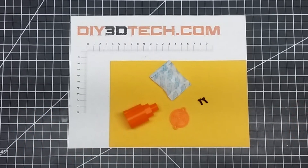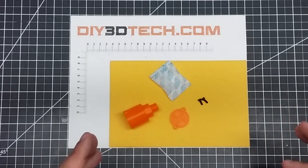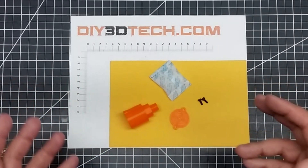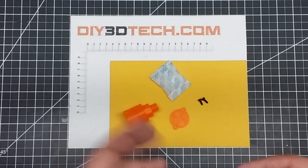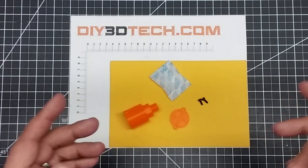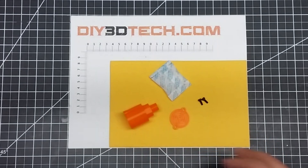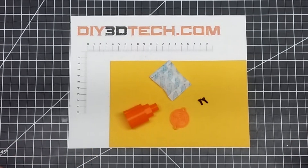One of the things you guys know is I've been experimenting with the vacuum chamber to dehydrate my filament. One of the pieces I want to do is, since I'm using it to dehydrate the filament, when I allow the chamber to repressurize, obviously if I'm letting moist damp air back into the chamber, most of the filament is dry — I want to keep that air as dry as possible.